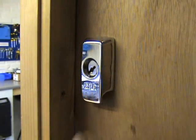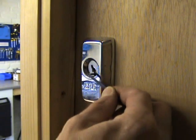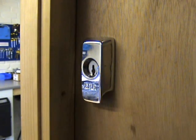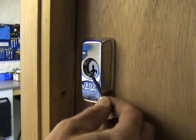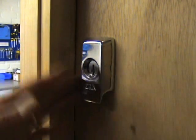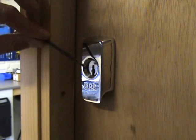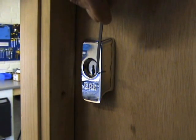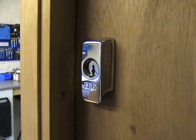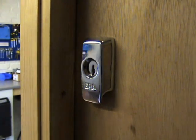So like I say, the most important thing with regards to the rotating disc - that's not going to get in the way. All that's there for is to basically prevent the lock being attacked, i.e. drilled, although we know that they can still be drilled. But from a picking point of view, it's all pretty much exactly the same - it's just trying to find that nice sweet spot on the plug to get your tension tool on. Obviously if this is a right-mounted lock, if there wasn't a door frame here, you could have the tension tool at the top of the keyway to rotate round. It's all about change and adapt - but hopefully that's helped you out a bit, cheers.